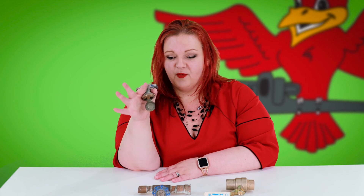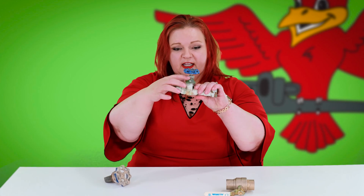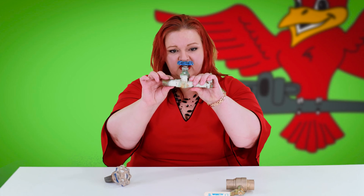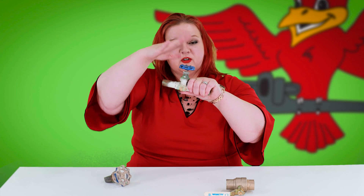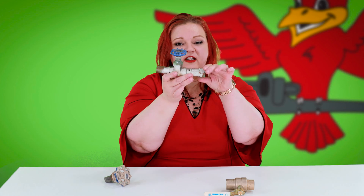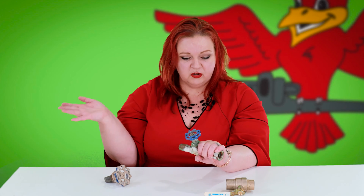The gate drops in valves like this all the time. You think you're doing a good thing — flooding in your bathroom, you shut off the water to your home — and then you're calling us because you can't get the water back on. That is very common and typical of a gate valve. They harden like this; you can see all of this hard water buildup on here. This valve didn't stand a chance — it's actually frozen in the closed position, which is why you can't see through this pipe. At this point all you can do is remove the gate completely and not have a shut-off valve at all.